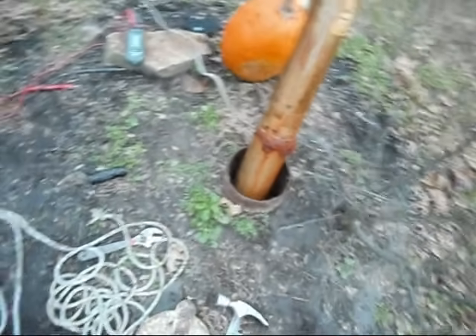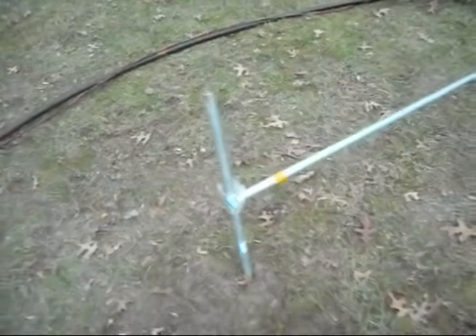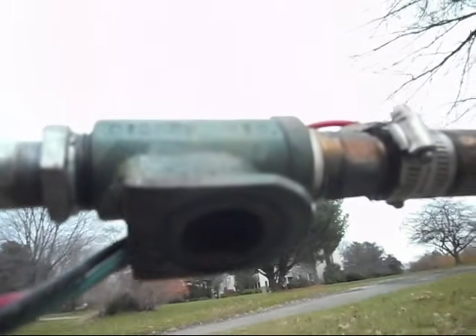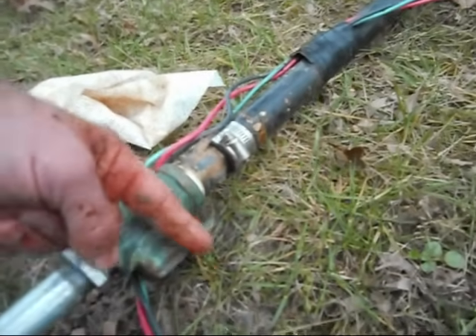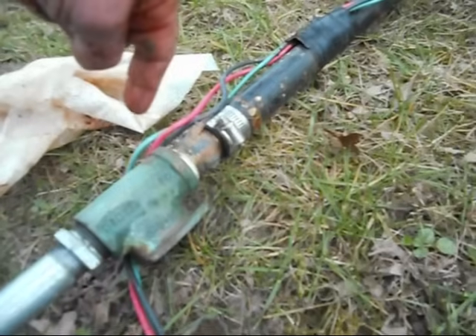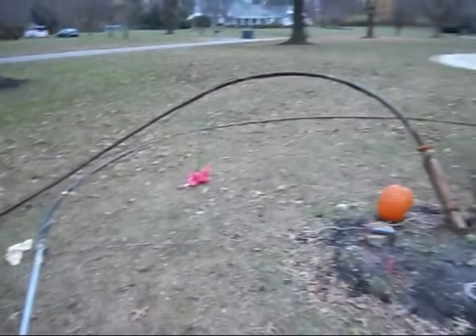The process of getting this out hasn't been as bad as I thought. So if you plug this pipe down into this shoe fitting, that connects back to the house and that's what goes down to the pump in the well. So when you pull it up this way, that releases it — and that's what you need the T-bar for. It sort of worked.